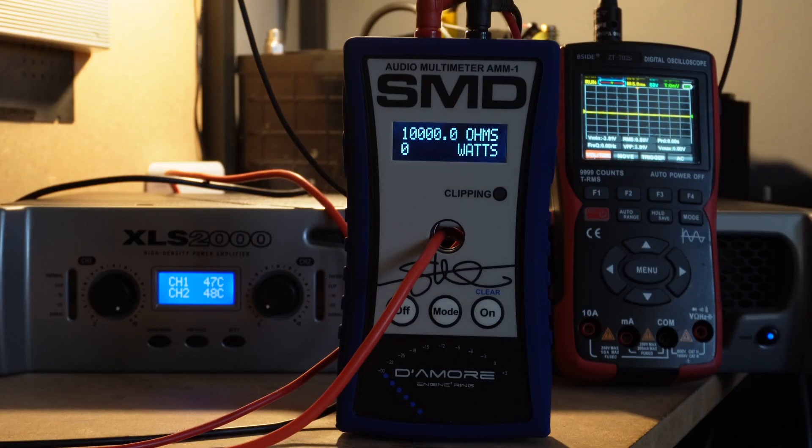For this test, we're doing a 40 Hz burst, clipping just a little at the top of the rail voltage, to see if we get more than the 2,165 watts we got on the continuous sine wave. It has got some dynamic headroom — 2,328 watts. Very nice.